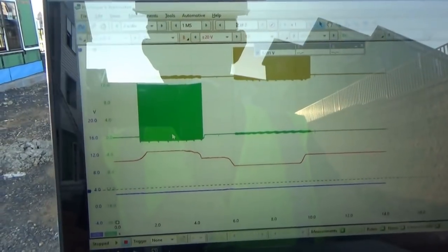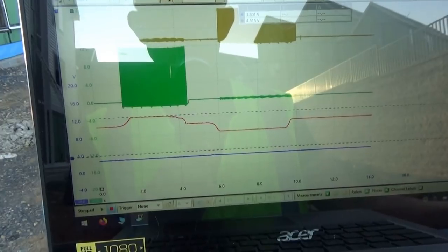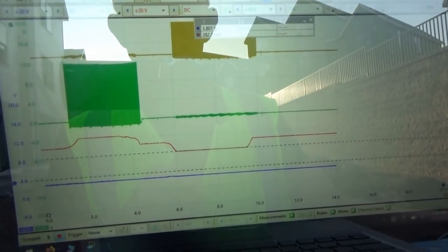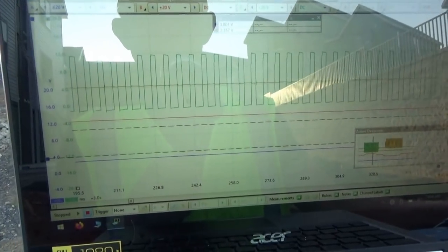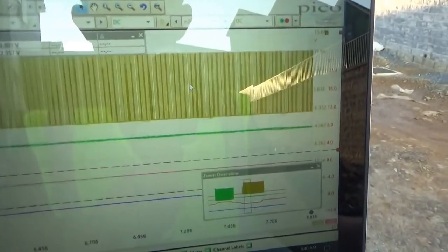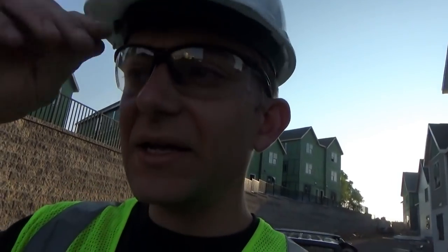For the drive, on the red channel — the Y — drive forward is 4.4 volts and reverse was 280 millivolts, starting at 2.3 volts. When we went forward, our duty cycle was maybe 30 percent. However, when we tried to go in reverse, our duty cycle is like 10 percent. So the drivers seem to be doing their thing, but why are they so out of calibration? It's basically giving three times the voltage forward and a lot less in reverse.